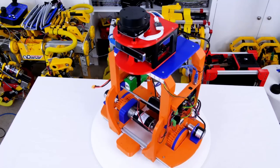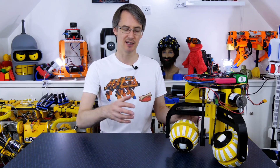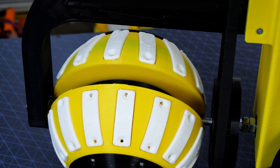All together I'm pretty happy with how that's turned out and how well it runs on carpet as well as a smooth floor. I was pretty surprised it worked so well with those little wheels and that minimal ground clearance. I'd really like to turn this into an autonomous robot, perhaps replacing my other little development platform for ROS experiments - see if we can get it to navigate and move omnidirectionally. Obviously there are lots of improvements we should make to the wheels: getting more traction by having more TPU sections, probably redesigning so that ring can be TPU, perhaps even printing the whole hemisphere with dual extruders so it's entirely coated with TPU for traction. The other thing is removing the gap between the two hemispheres which is currently nearly 20mm while the axle is only 8mm - perhaps using an aluminium plate of about 3mm running all the way through with bearing mounts on each end as well as the drive pulley, so we could get that gap to less than 5mm, which would help quite a lot on rigid surfaces.